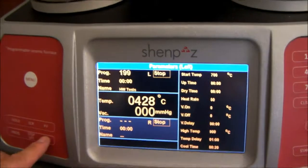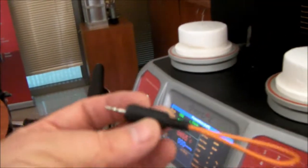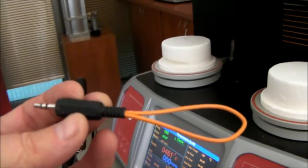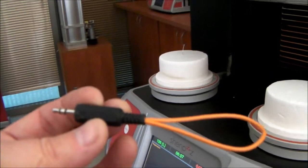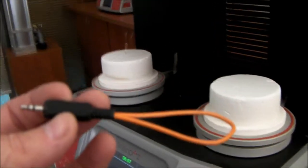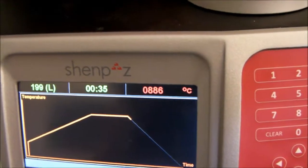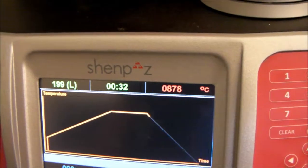Press Start and allow the cycle to run and heat up. We prepare a small tip of silver like this. To check the calibration, we will arrive to 960 degrees. In parallel, we shortcut a stereo plug with a wire in the back. And then we will be able to use this following the preheating of the furnace. When the furnace is already at around 900 degrees, we will be ready to make the calibration.